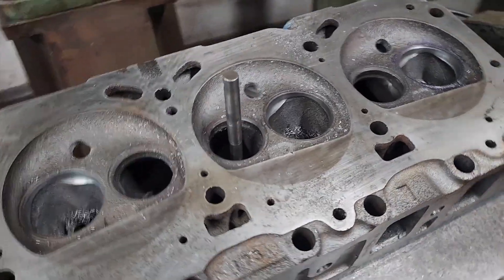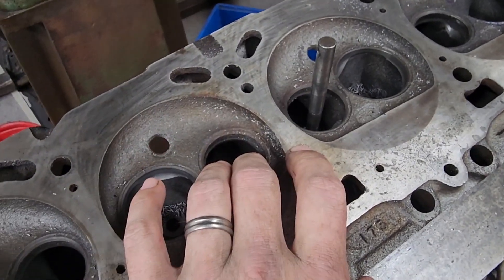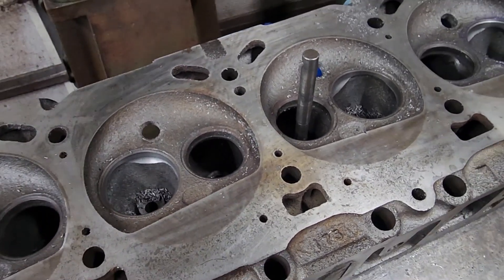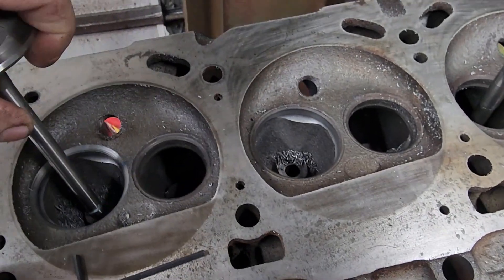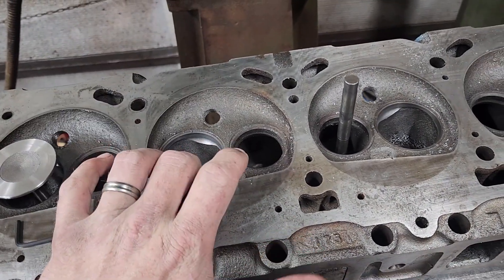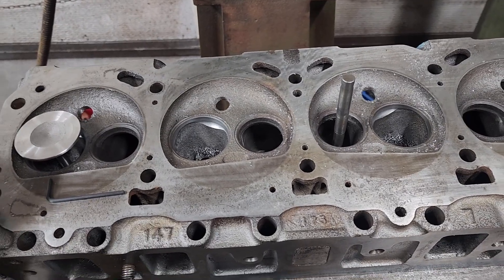I'm interested to see how well these perform when they're done, because the theory would be that air would sit there and create its own ramp. I do know certain guys that said they've done this and it made a huge difference. I've also talked to guys I respect a lot who say they did all this work and it did absolutely nothing — so we will see. I have a feeling it will do something. I do believe doing a high-end multi-angle valve job and opening the bowls up nicely is going to do more to benefit it than this, but altogether these heads are going to perform well. If you like these videos and want to see more Oldsmobile or iron head work, please like, share, and subscribe. Thanks for watching, guys. Hope you have a great day.